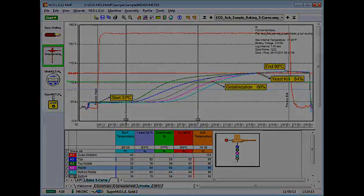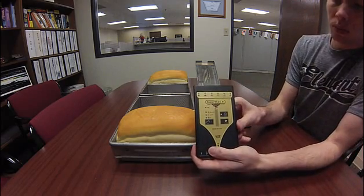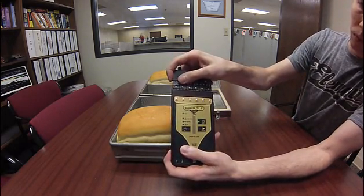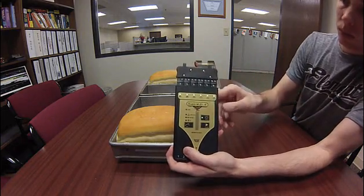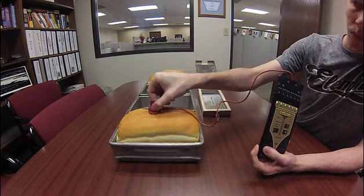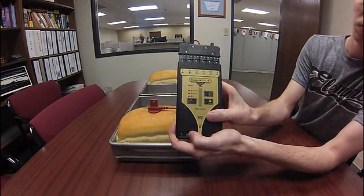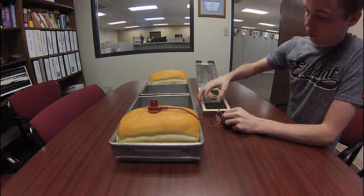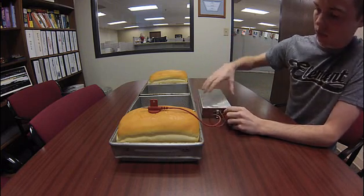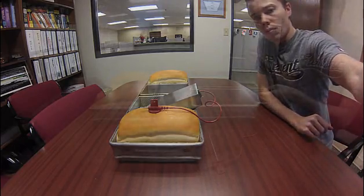Let's take a look at how you would want to set up a breadometer. We'll look at the correct way to set up a breadometer with the unit being plugged into a SuperMole Gold 2 and then inserted into your bread or your baked good, making sure that the thermal barrier that the SuperMole Gold 2 goes in travels in the oven in the same bread pan as the probe. This will help avoid the equipment from getting tangled or caught in the oven, especially if you have a conveyorized process where the bread pans are switching from a slow conveyor to a fast conveyor.